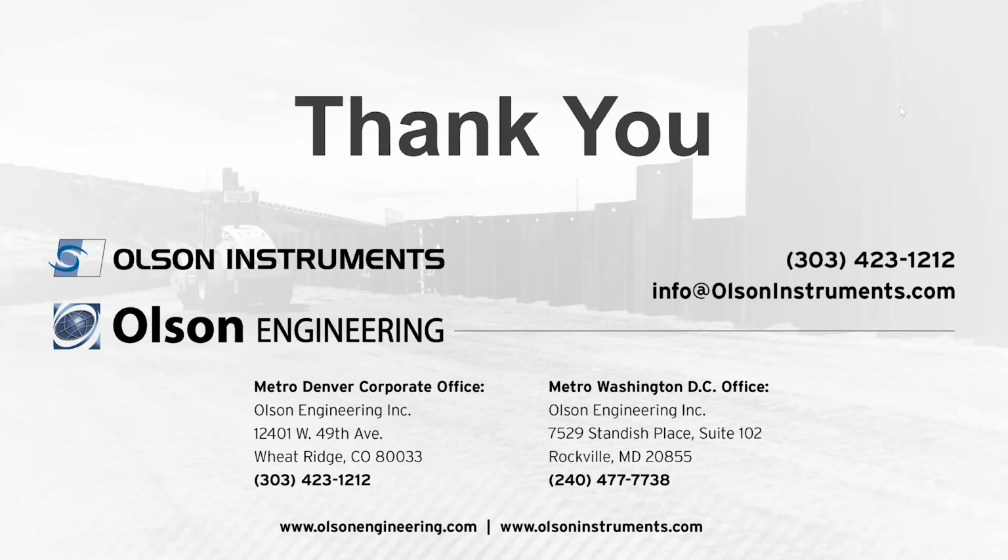So it's a different way of thinking of quality assurance or control of compaction, for sure. Okay. How do you determine the Poisson's ratio to compute the value? Yeah, that one is an assumption. You can assume a Poisson's ratio based on the soil type. That's the easiest way to do it practically. And that number is often, I think, 0.35. Yeah, between 0.3 and 0.4. The software lets you set that to whatever you want. Oftentimes people will set it for one soil type and then leave it alone for any work they're doing with that soil type.